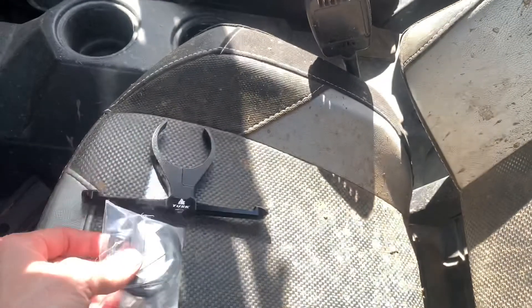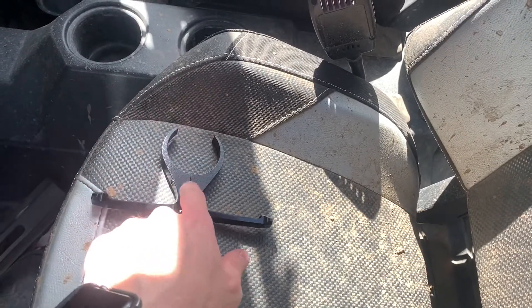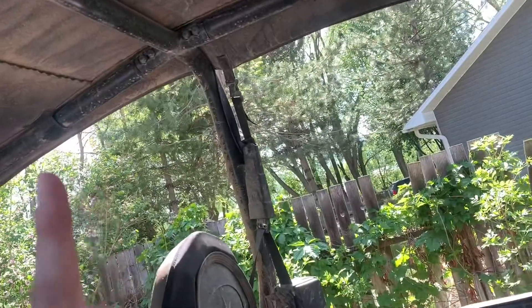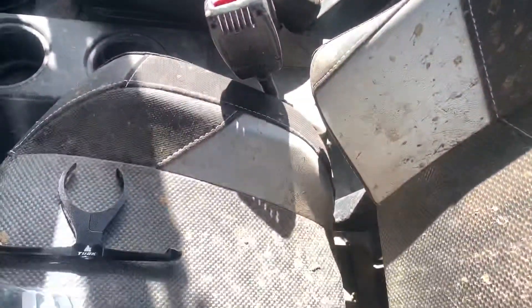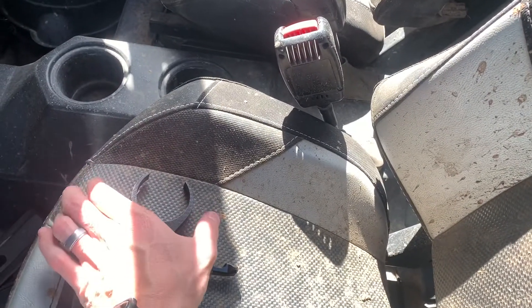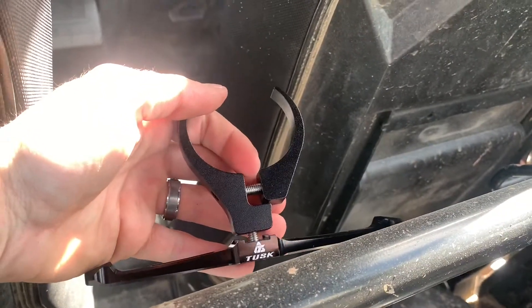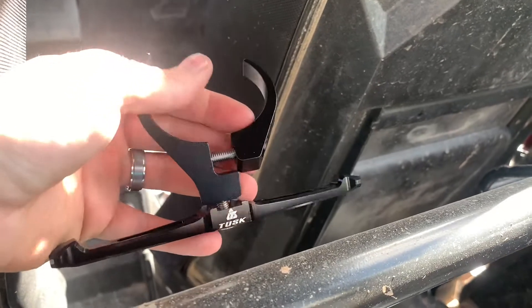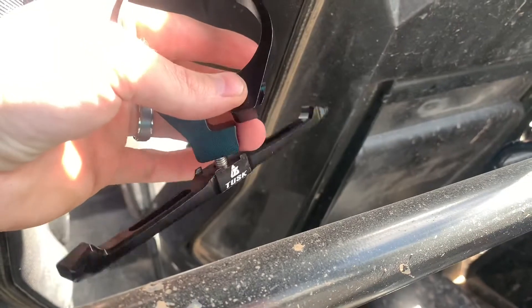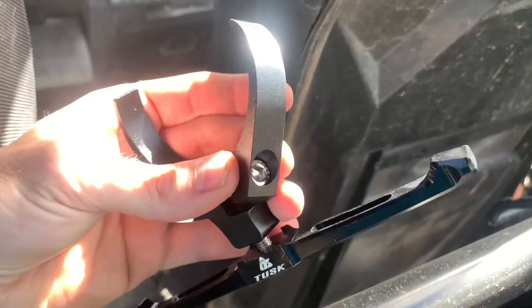It's probably hard to see, but it's a one and three-quarter inch bar. Pull that out, slide it into the insert after you've loosened up the nut — or you could take the grommet, put it up around the bar where you want it, then loosen the clamp enough to spread the jaws apart and slide it over the bar. You can see I've unscrewed this screw here almost all the way so I can open the jaw wide enough to get around the bar. I've also loosened the bolt at the bottom to orientate it out of the way.